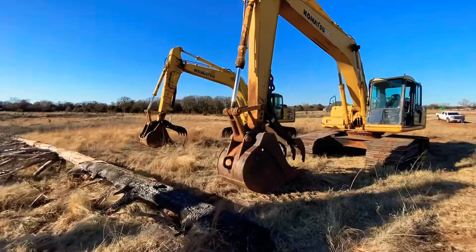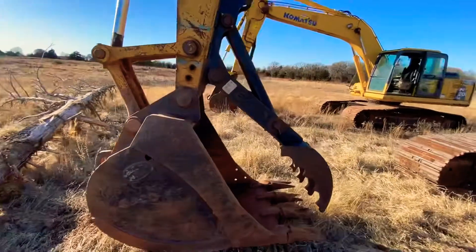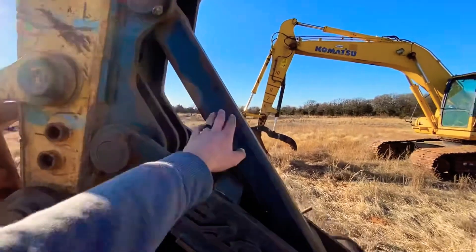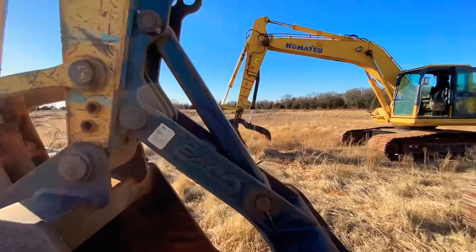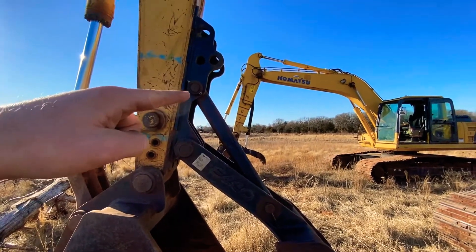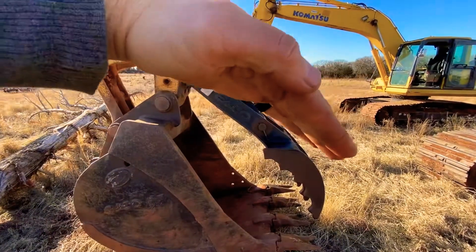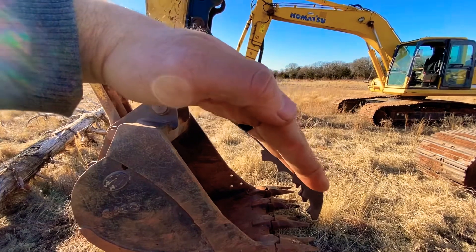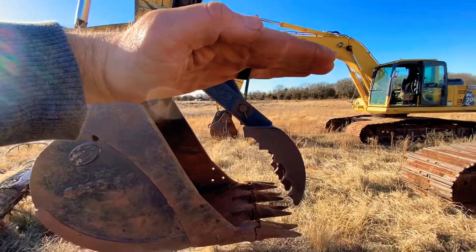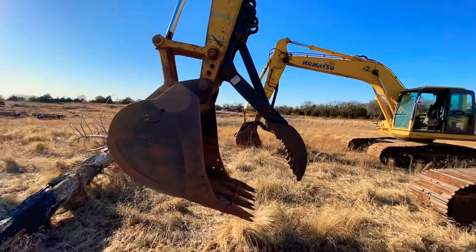While he's moving that one back around out of the way, I'll go ahead and show you this machine here — it has a manual thumb. The manual thumb has a solid brace arm, right here. In that brace arm, you can unpin it at the top and move it to one of these other holes to adjust the angle where it'll hit the bucket. So if you're going to use it a lot or grabbing smaller items, you may have it at this angle so it's closer. If you're not grabbing as much, you may move it out here, or you may move it all the way up against the arm if you just want to dig nonstop unhindered.